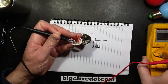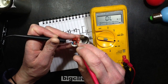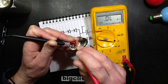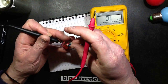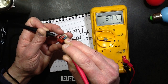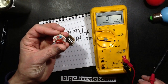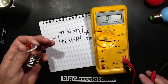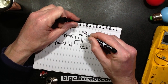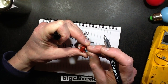Although I'm reading this across the capacitor so hopefully that's not going to skew things too much. The meter's not liking that at all, because that resistor's across the capacitor. It could be 560 or 680 — not 100% sure. I'm going to say 560k. It's tiny — far too tiny. I'd have rather had a 1 megaohm quarter-watt resistor for that. They've got plenty of space in there; they don't really need to skimp that way.